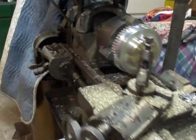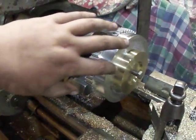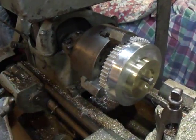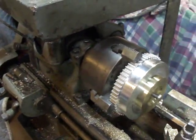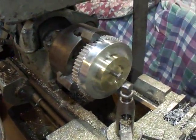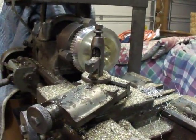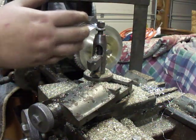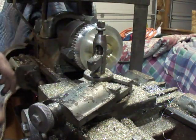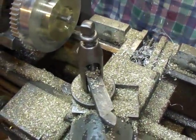I'm making the piston. I just put it on a mandrel and threaded a 3/8 inch hole, since that's going to be the size of hole I need through it. I just faced this other piece off — I have a few of these weird pulley blank things but they're nasty, they don't cut well. I absolutely hate brass, especially cast brass. It comes off extremely hot — you can see all the little red marks on my hands where the brass shavings were hitting. They don't come off as normal shavings; they come off as tiny little pieces that just spray everywhere.